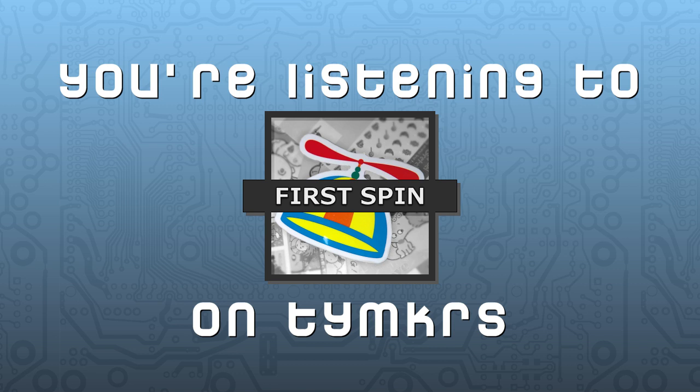In the code, you're timing those pulses, and that gives you a number indicating how much the sensor is displaced in one direction or the other. The different ways you interpret that is how you get things like tilt, acceleration in a direction, tapping, or vibrations.